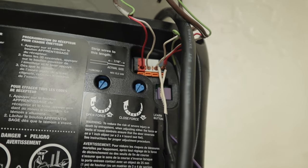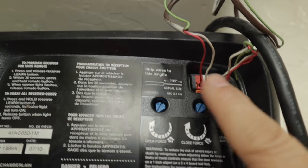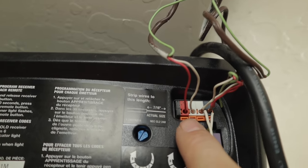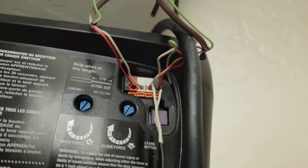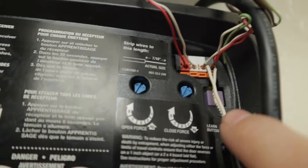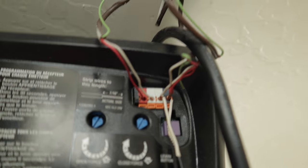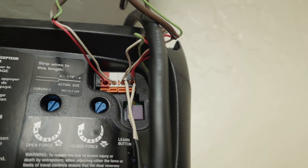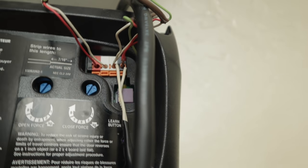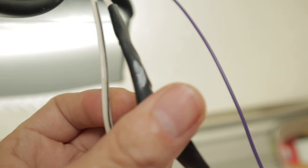Now we're looking at the back of my garage door opener — mine is a LiftMaster made by Chamberlain, half horsepower. This little section is where the garage opener and sensor terminals are located. The left side has two wires, a red and a white — the red in the red and the white in the white — and that's for my opening button on the wall inside the garage. The other two, gray and white, are for the sensors. There are actually two wires that come out of the ceiling and go to the right-hand side — the gray and the white — and those go to each one of the sensors, so there are four wires total, two for each sensor.